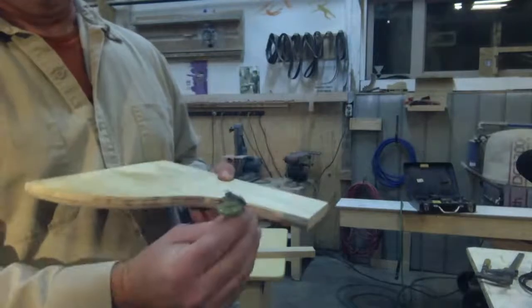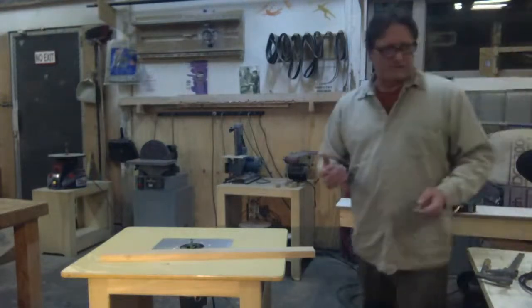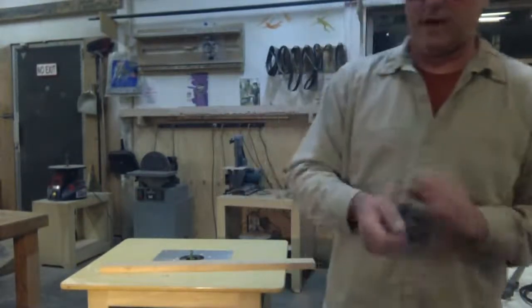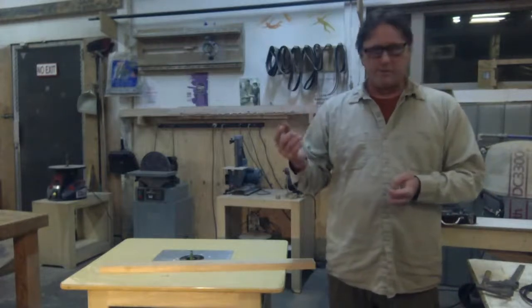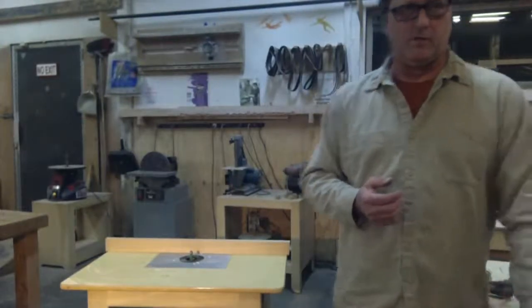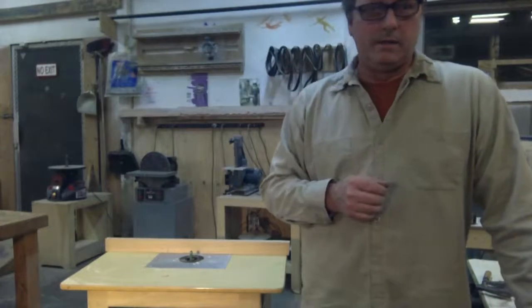After this piece was made, we made a cut with a bit like this. There are lots of different things that you can do with the routers. You can do inlay work, which would be using the router to route out a space in a board to fit another piece of wood into. Routers are used constantly for installing hinges. They're used a lot for, like I said before, flattening the material with a jig. And there are plenty of templates available for doing inlay work or jig work. You can look up in woodworking catalogs and buy them or make your own.